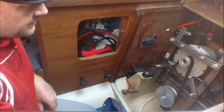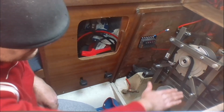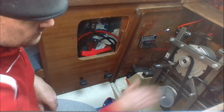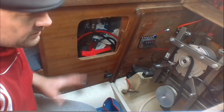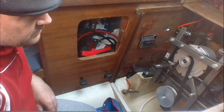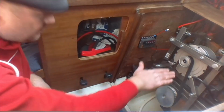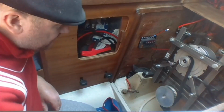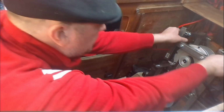Anyway. The batteries are now at this height too, which is the same height as the diesel engine used to be, and the batteries are probably about the same weight. So in that respect, it's not really a problem to have them at this height back there, but I would like to move the batteries where the diesel tank is. I think that would be better.